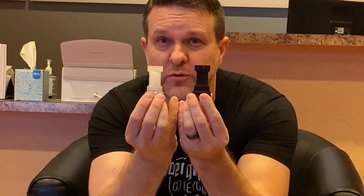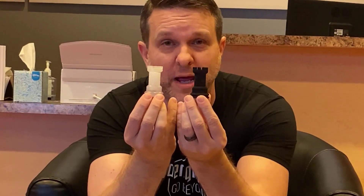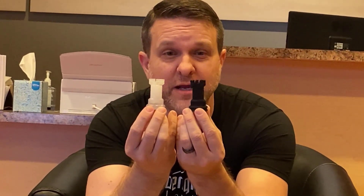Let me show you some samples of how this actually works. In the case of a clear part, you can take something clear like this chess set piece. The original clear part was transferred into RIT dye to turn out black. The longer you leave a part in, the richer the color will transform through the clear part and into the dyed piece upon completion.